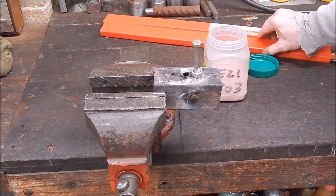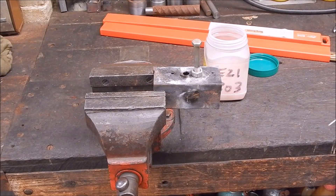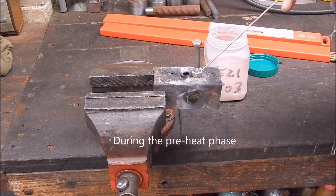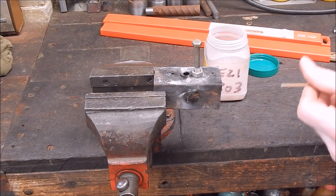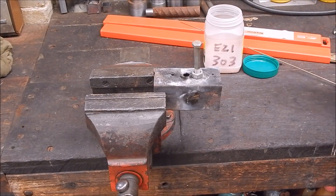I'm using uncoated rods. I don't like coated rods because by using an uncoated rod you can put your flux on first, let it do its work, then apply the rod. If you've got a coated rod, you're putting on the flux and the rod at the same time, which is rubbish. You want to get your flux all set up, put on just the amount of flux you want - you can totally control it by doing this with an uncoated rod - and then just put your bronze on as much as you need without adding any more flux.